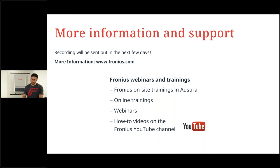One question about the network and the Solar.web integration. The idea for multiple systems, like if you have a Verto, a Gen24, and a Tauro, there is a different story to the visualization on Solar.web and to the system power control that I mentioned. So for the monitoring, you still have to integrate every Fronius inverter to one system on Solar.web. You just add it as component, and then you have one system shown up with multiple inverters in it. So one summed up production will be shown to you. So this is how it works with the monitoring.